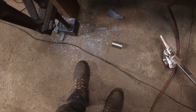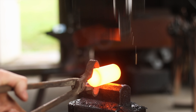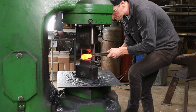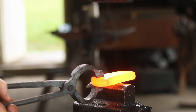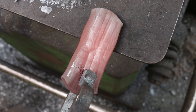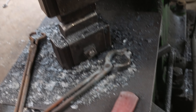With these super alloys, or aerospace steels, every single little thing is a victory — just to cut it is a victory. Interesting how it has no scale on it. It maybe doesn't look so weird now, but when forging it sure does. Such a clean, clean material to forge. It's so hard to forge, but with the drawing dies in here it's actually going way better than I thought it was.